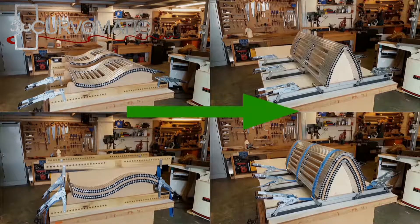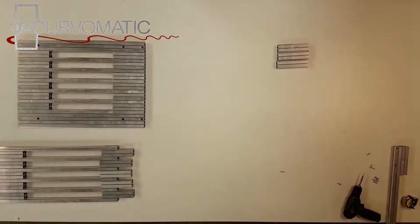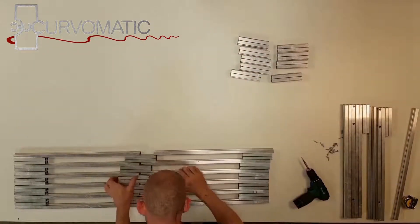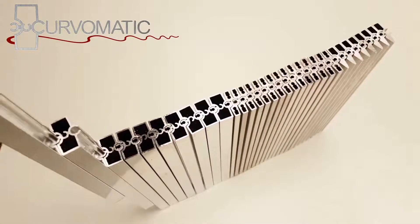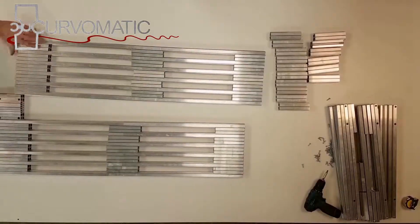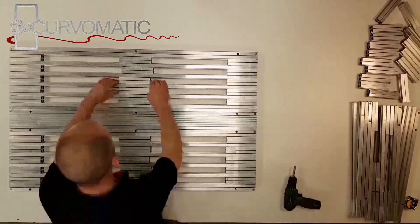To reconfigure from two foot to four foot in length, remove the screws and slide off enough extrusions to make up half the width that you require, then slide out the six inch lengths from one end. Take another half section and join the two end to end by sliding across the six inch lengths. Repeat this process to make the other side of the skin. Tighter radius sections are made using the two smaller extrusions in conjunction with your 185 millimeter radius kit, assembled in a half overlay pattern from one and two foot lengths and affixed by the adjacent four foot extrusions from the joining kit. Slide the drilled four foot sections from the joining kit onto the edges to finish.